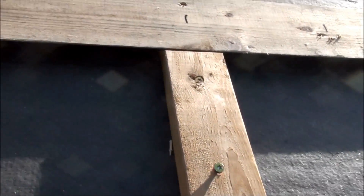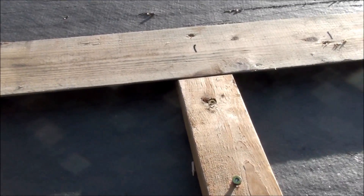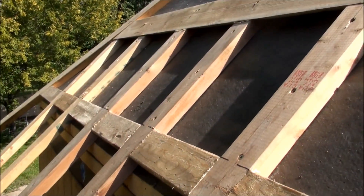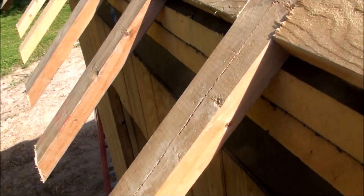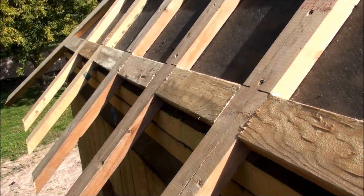With this design, as the weight of snow — and we get tremendous amounts of snow here, like last season we had just over 14 feet and the season before just over 13 feet — if the snow does remain on the roof there's quite a bit of snow load, and that's one of the reasons I've got pretty decent pitches. The lowest pitch I have is a 6-12 pitch and with the metal roof the snow should slide off more easily. I don't want to be getting up on the roof during winter months to shovel it off. I just wanted to show you the initial stages of building this overhang — there's much more to do to box in the soffits and for additional support. But this design is a way of giving yourself an overhang even though you have a completely enveloped insulation around your structure.